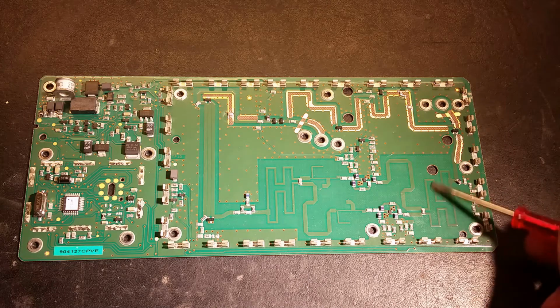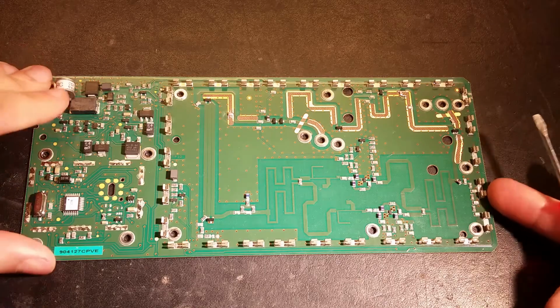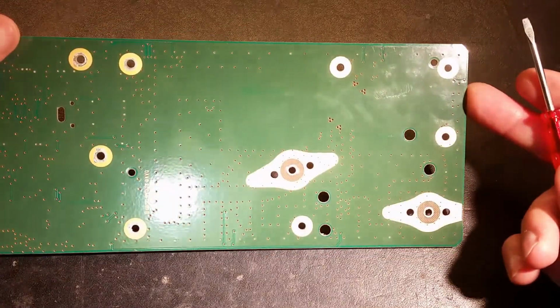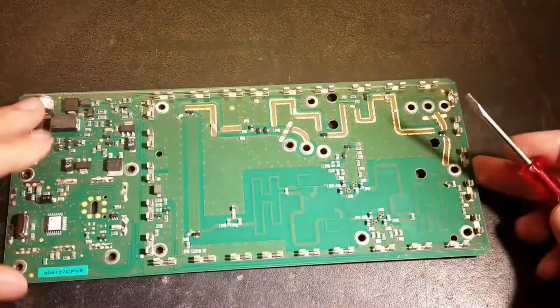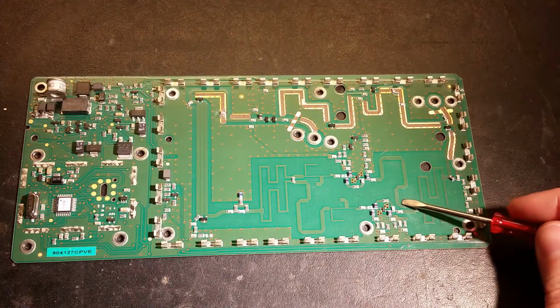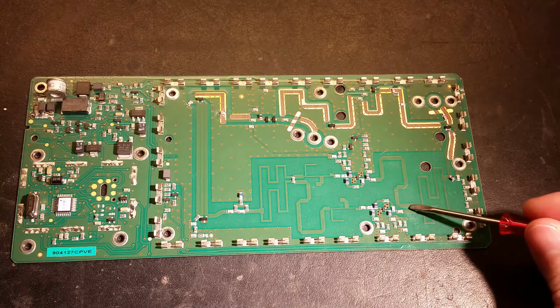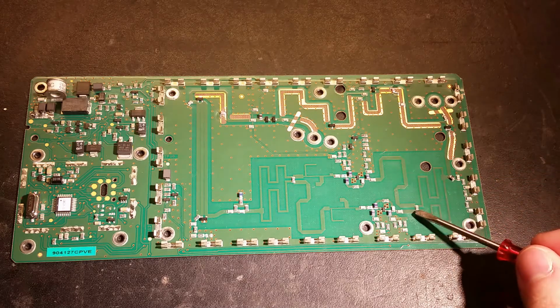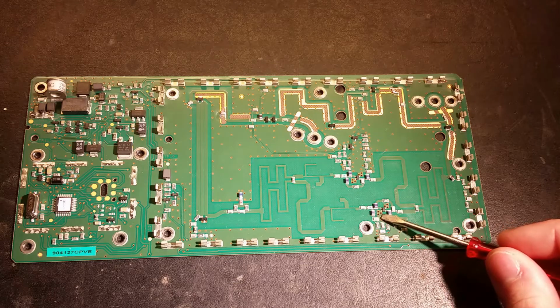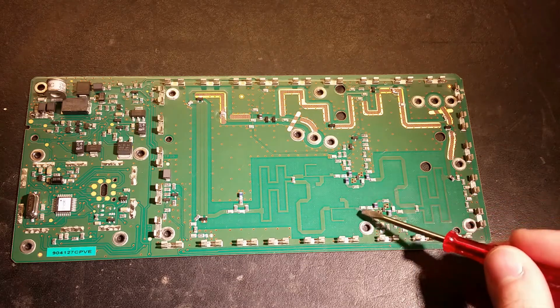We go this path here. You see we've got a capacitive inductor here. On the other side there is a ground plane, so it forms a capacitor to the ground plane, especially this one, which is much wider. This is a bit longer and this is a bit shorter, so the signal goes to this amplifying unit first. I believe those are amplifying units.